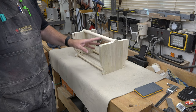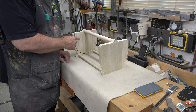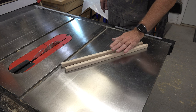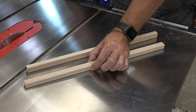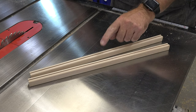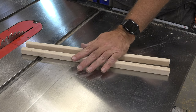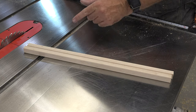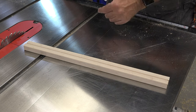Once the drilling is done, take an inside-to-inside measurement from end to end — that gives us the length for the last pieces. Using five-eighths-inch thick maple scrap, cut pieces three-quarters of an inch wide. Down the middle of the five-eighths-inch side, run the width of the table saw blade three-eighths of an inch deep, and put a one-eighth-inch roundover on all four edges. Cut these strips to your inside measurement — in my case, fourteen and three-sixteenths inches.